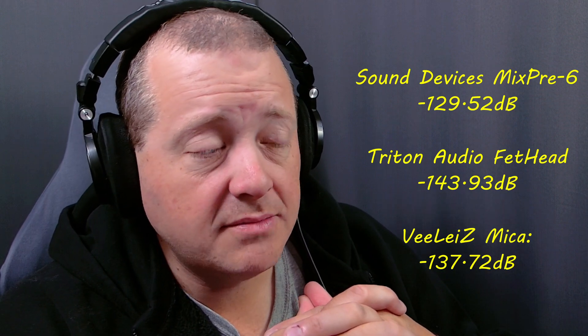Now if you perform these tests on your own system, or if I did it again on mine, results may vary based on testing conditions. But considering that both the Mika and the Fethead created noise floors below the theoretical minimum EIN of the Mix Pre 6 alone, I would say they're both very effective in our particular circumstance. So is the Mika something you should look into? That's up to you, but I would say it is definitely a very good contender for your money if you're looking for a solid circuit that's going to give you low noise performance on your dynamic or ribbon microphones.